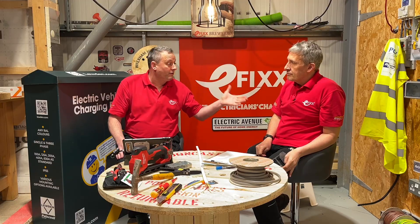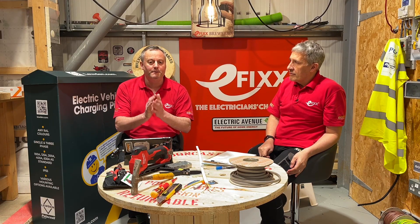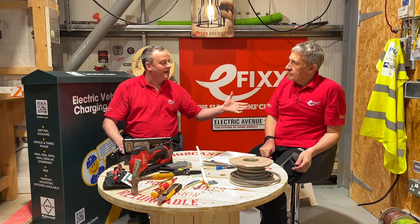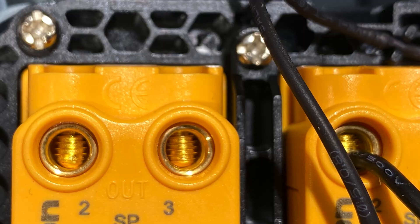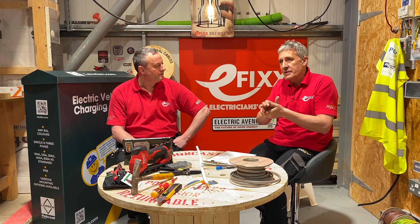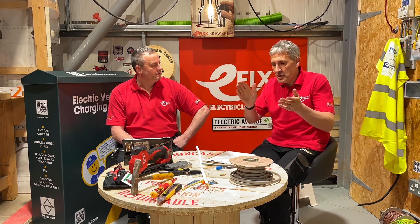That means we can carry more current. The keen people in the electrical forums will be saying the equipment we're connecting to is not rated at 90°C — hence there's a one-year lag lead time. Obviously, accessories: if there's no rating on there for the terminal temperature, you have to assume 70°C. Manufacturers are increasingly going to be rolling out a 90°C conductor termination point, because as we put more insulation into buildings you're going to need higher conductor temperatures.